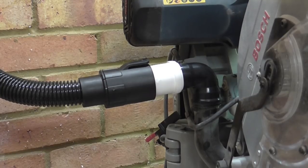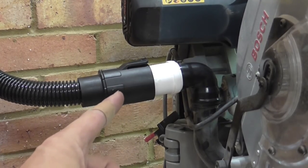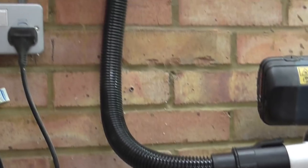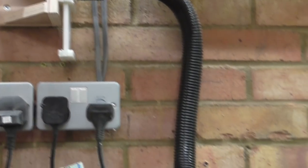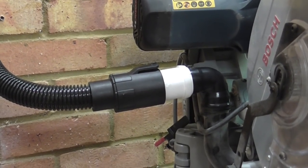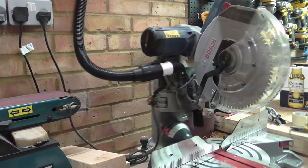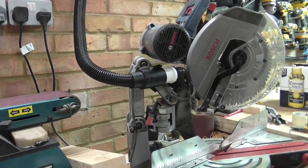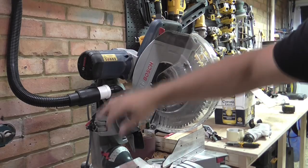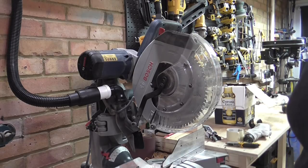The mitre saw I've had to use a combination of couplings — a straight waste push fit coupling attached to a wider 50mm coupling, attached to some 32mm hose. The good thing about the couplers I've used is they've got rotating cuffs on, so when I move the mitre saw around it enables them to move with it. The dust extraction on this mitre saw itself isn't all that great, so I'm probably going to build some sort of cabinet to better extract the dust when I'm cutting things on the mitre saw.